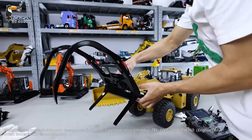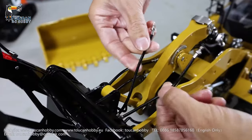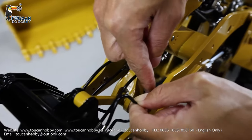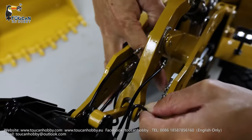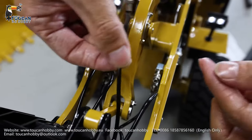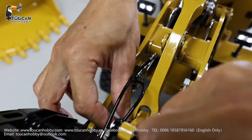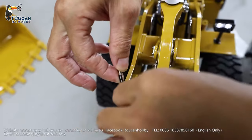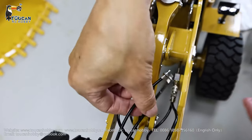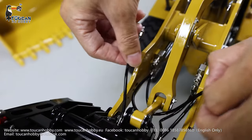Now we connect the four holes — each side has two holes. The left two holes connect to the middle coupler, the quick coupler from the hose. Unlock it and push — locked, secured. This hose goes under the arm; otherwise it will be tangling with the arm and pulling too much on the hose. The other one also connects to the middle — locked. The right side has two holes: go under it, one to the left and one to the right.